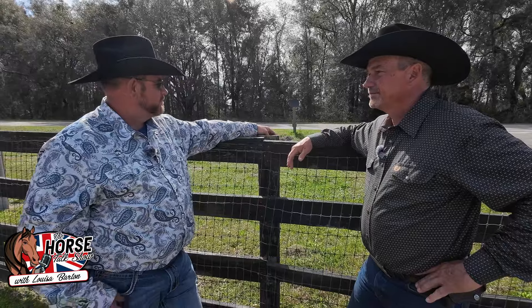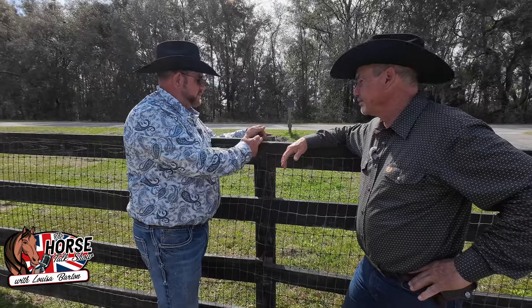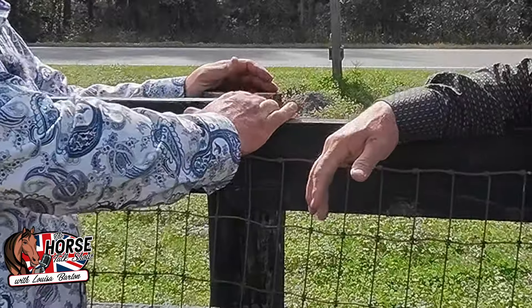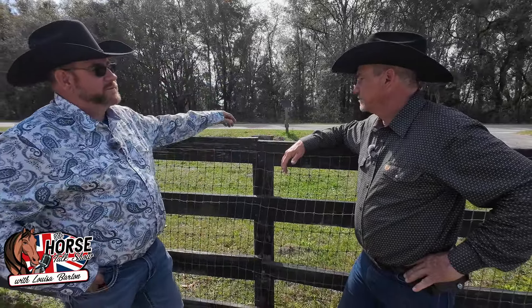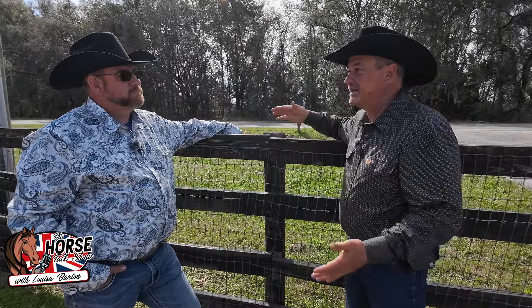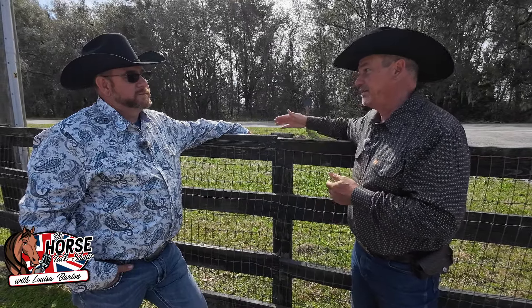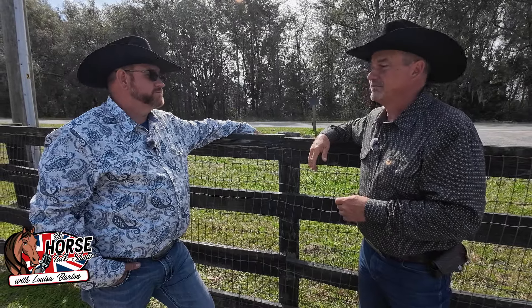That's where you get this hollow core. Then when you try to put a board up and shoot a nail or screw in, there's nothing inside to hold it — and that's when you get the problem where you can just shove your nails in and out of the post. I just learned something here, because I always thought flat tops were correct. Now talking to Tommy, I have a better understanding of how a post can last longer.